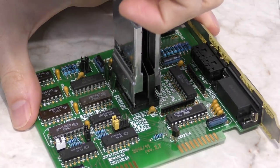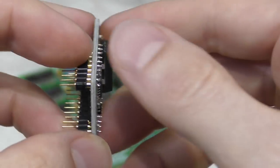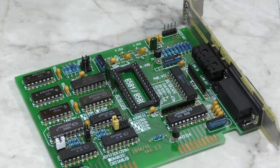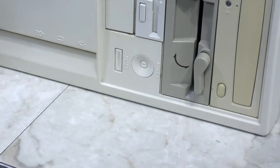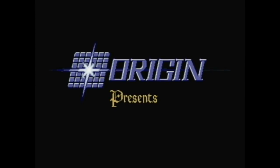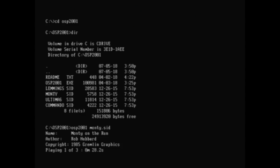Let's pull the card out and pull the 6581 chip out — I want to try something else. This is a SwinSID Ultimate, a modern replacement for a SID chip. It's actually a microcontroller that emulates the SID. This is a really amazing little piece of engineering. It's too bad nobody can produce real SID chips anymore, so this is the closest we can get. Let's stick this down in here — this isn't what the chip was designed to work in, but it will still be interesting to see if it works. Interesting, it made a little ding sound on power-up. Running Ultima 6 again — other than the volume being a bit lower, I can't actually tell any difference. The introduction music sounds about the same too.